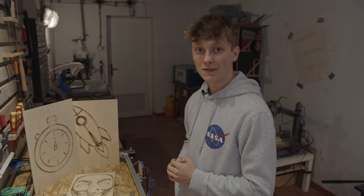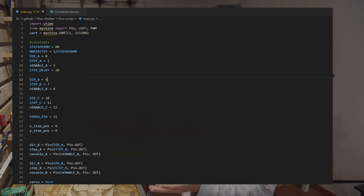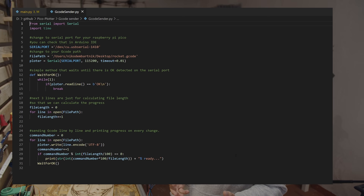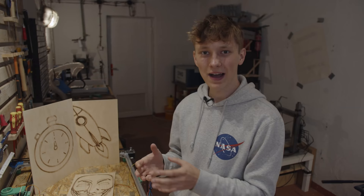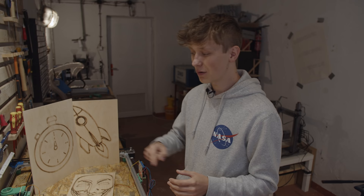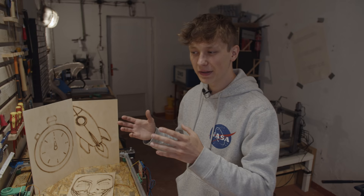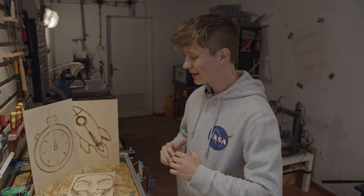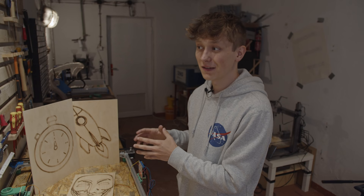When it comes to the code, there were a lot of small bugs. The circles weren't really perfect — sometimes the machine was doing some weird stuff — and that was basically connected to bugs in the code and to some small mistakes. I decided to figure out on my own how Bresenham's algorithm works and how to implement it, instead of finding a solution online. There were a lot of problems with that. Bresenham's algorithm is essential for any kind of CNC machine, because whenever you want to draw a line you basically need that algorithm, and whenever you are drawing a circle you are actually drawing just a lot of lines. But after fixing all of those small mistakes, everything started to work really perfectly, and the coding part was not only really interesting but actually really enjoyable to write.